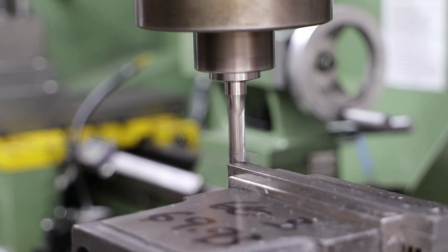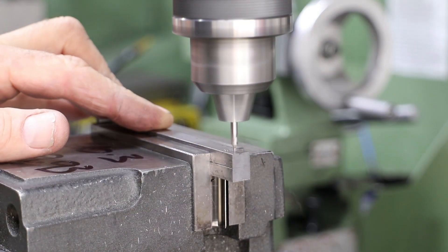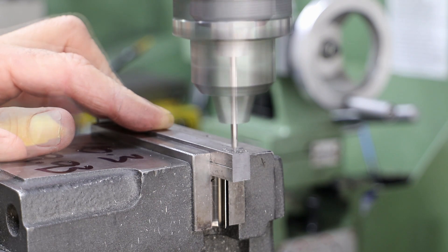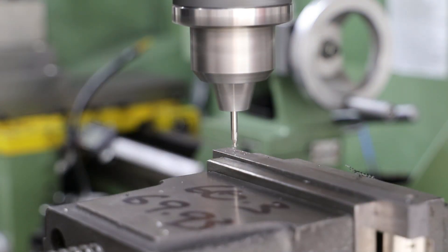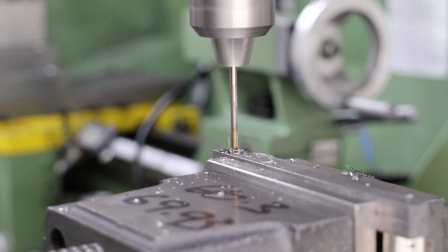The first thing I need to do is cut a couple of lengths and then use an end mill to bring them into dimension. As we can see, I'm working with a pair here, so having machined them to length, I center drill and drill the mounting hole for the cylinder cover end, which is located in the center of the bar. I then move on to the holes at the motion plate end — these are the holes that are handed, but that doesn't matter just yet.